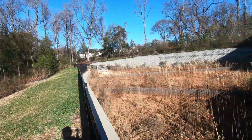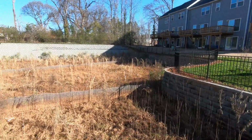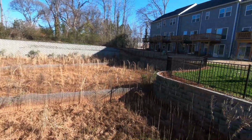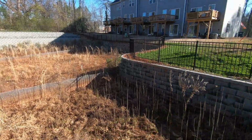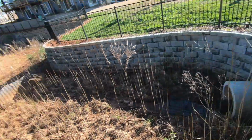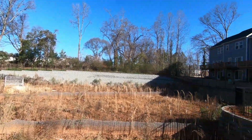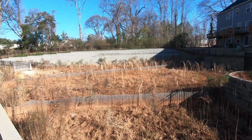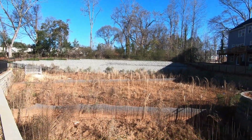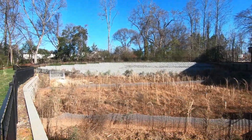It is going to be a dry pond, so there's no filter, and the water is going to come in and go out that box. It'll be dry when it's not raining, but it'll fill up because it's a, I don't know, 24-inch pipe, maybe a 30-inch pipe coming in, and it'll be going out a 4 or 6-inch hole in that box. I know it seems stupid to go in and then just go out into the creek, but it slows the water down and lets the silt settle in here. So really what we have to do is very close to grade.